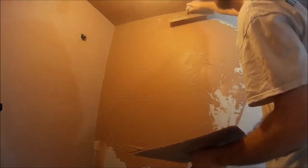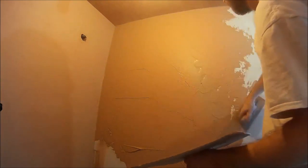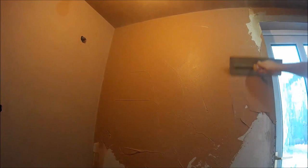I have started top left — that's the routine I keep myself in. Coming to the bead, this is where a lot of beginners will have problems. Getting beads filled out on your first coat is important. If it's really heavy, check it with your trowel and a straight edge. If it's going to take more than three or four mil of plaster, put two mil up it, keep it behind the bead, and strike the brush across — that'll stop slumping. Slumping is not good when you're learning.